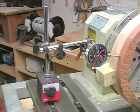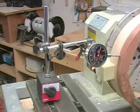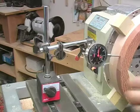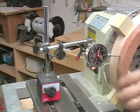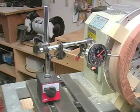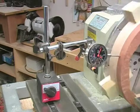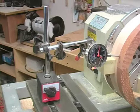A lot of times when you put the rim on, it's actually centered very nicely just to begin with. In this case, I just slapped it on and I'm reading. You can turn the dial to 0, which is cool. And then I'm 5/1000ths out there. So total, I'm 5/1000ths out. I don't think anybody is going to see or care about 5/1000ths of an inch.